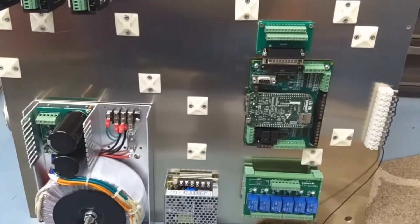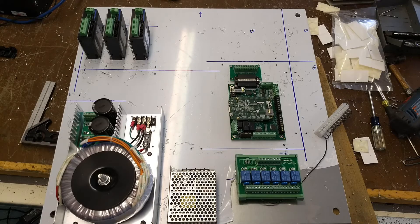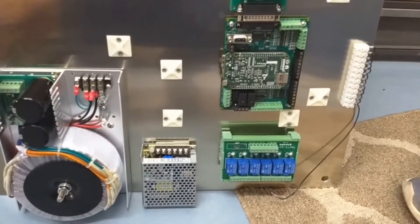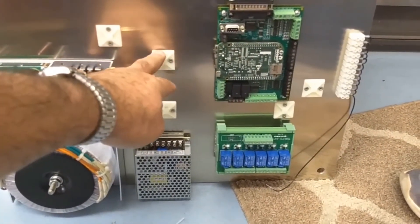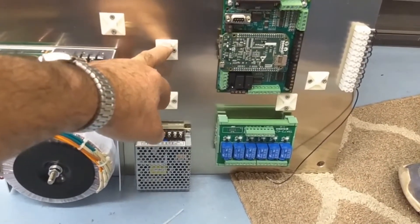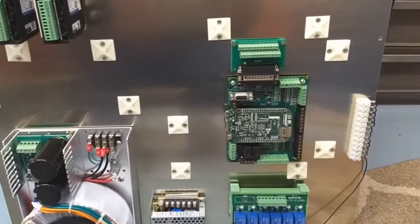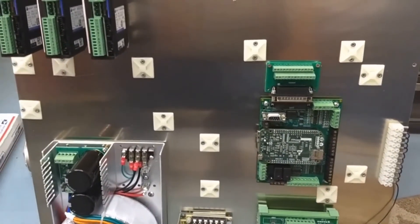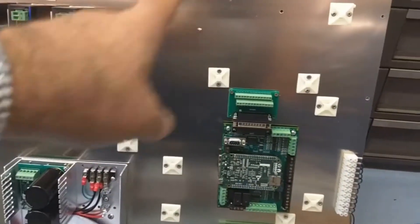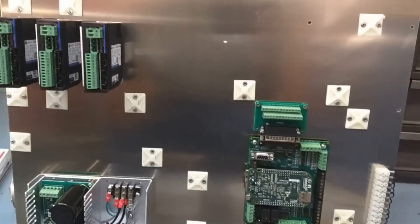You'll see in a previous video or pictures that I had the protective film on here, and I kind of laid out where all my wiring is going to go. Then I cleaned the plate and put these sticky tie wraps down, but I also drilled them and put aluminum pop rivets in so they don't come off — they're notorious for popping off when there's a lot of heat. So I chose to do this instead of using the Panduit system on this one.